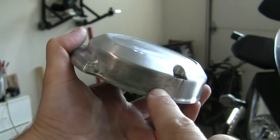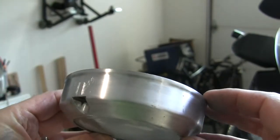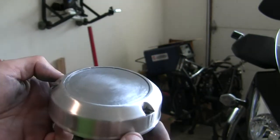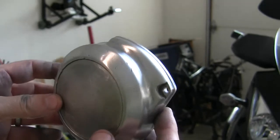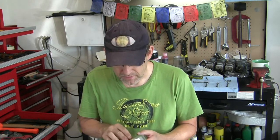So we're going from a kind of tarnished look — see those darker spots on this side with the 300 grit — and just sanding by hand until we're getting down to something that feels pretty smooth to the touch but still has a very brushed finish. That's pretty good for this step. Now we're going to move on to 600 grit as my next step up. This is wet or dry. Each successive level or grit should take a little bit less time — the initial is the most work.